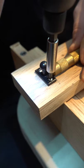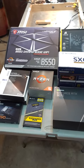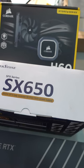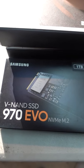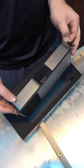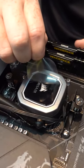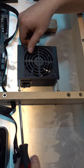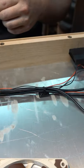To finish things up, we mounted the removable panel in the back, which clicks in and out of place with latches installed on both sides. Now we're ready to begin installing the PC components. For this build, we're using an AMD 5600X CPU paired with a B550 motherboard and 16GB of RAM. For the GPU, a Founder's Edition 3070, and a 650W small form factor power supply. For cooling, we're using a liquid AIO and some Noctua fans. For storage, we're keeping it simple with an M.2 drive so we don't have to worry about mounting a drive anywhere. We installed standoffs for the motherboard and GPU bracket, then the bracket itself, and installed all the components. Once everything was installed and plugged in, we cleaned it up with some cable management zip ties, and now the PC is fully operational.